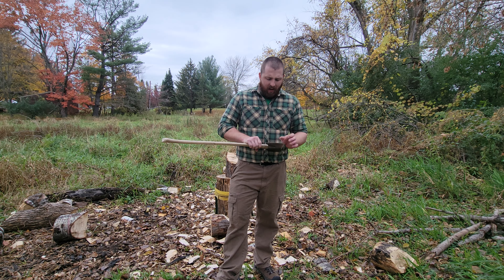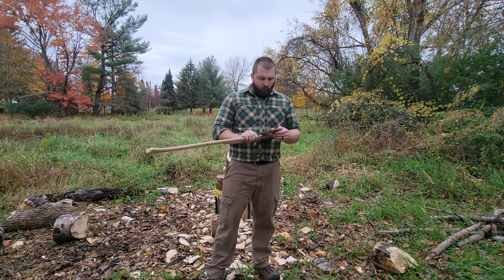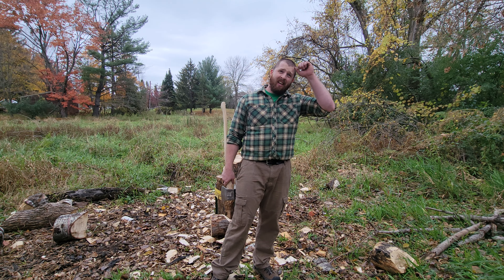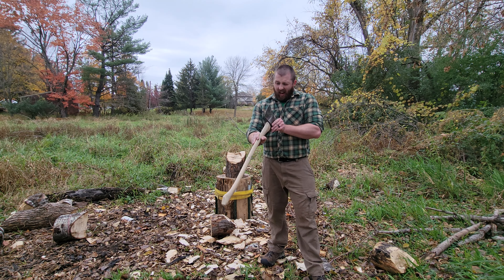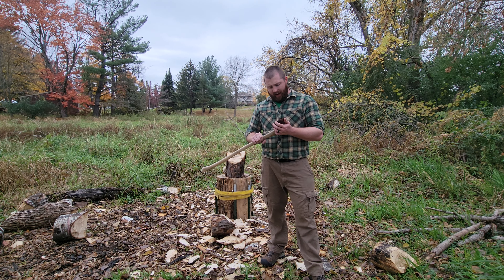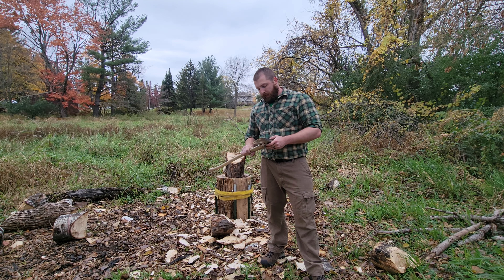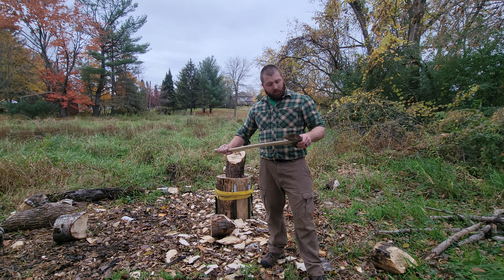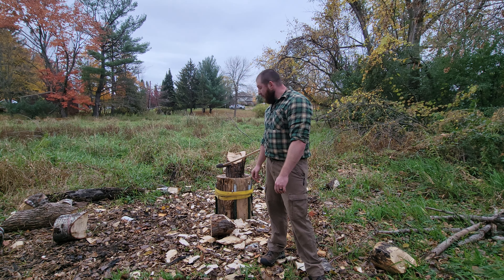I know you guys are on the fence about the FE6 — it's a great axe. It's a tool. Good steel — it's 4140, I believe. I use that for my blacksmith hammers, and I also have some 4140 for my hot cut chisels. It's pretty tough stuff. It's not the hardest stuff in the world, but depending on the heat treat, it'll get the job done. I have no rolling, nothing on the edge right now, and that's 20-degree micro, just sub-20 on the flat ground FE6. Left a bit of that high center line — did not want to get stuck at all. I think I just got to get used to the weight of it. It goes through an 8.5-inch maple pretty darn well.